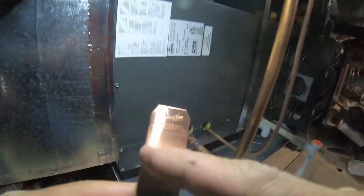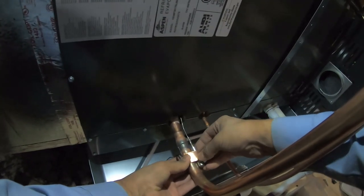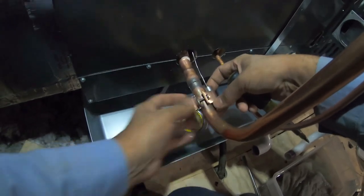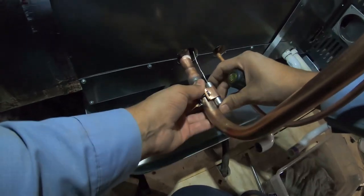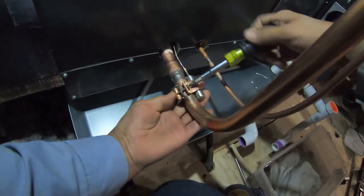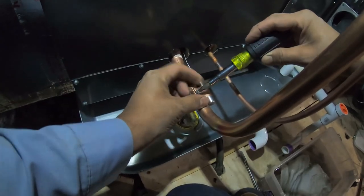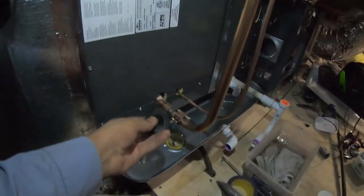The pipe is 7/8, so right here on the strap it says 7/8. What you've got to do is wrap this around and make sure your bulb is at the 10 o'clock or 2 o'clock position, then push it through that little slot. When you see the 7/8 marking, you know it's gone in far enough. Make sure it's parallel to the floor — I got that directly from the installation instructions. Once it doesn't move, give it maybe one more little turn so you know it's making good contact.